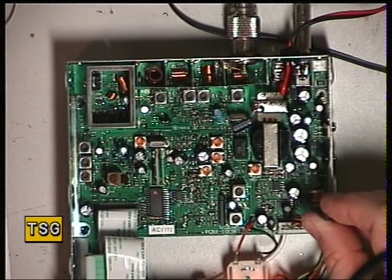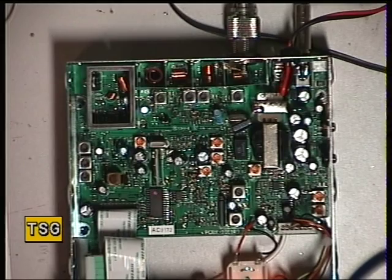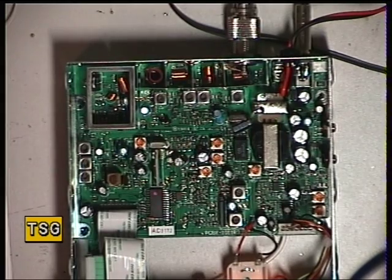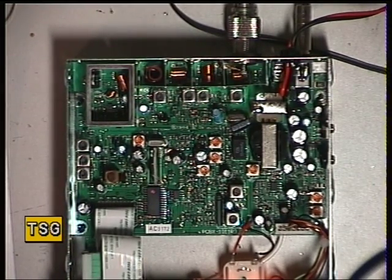I'll try to turn the power back up to four — we're getting three and a half. I don't think there are any further transmitter adjustments so that's what we're going to get. The thing about this test set — it's a commercial test set — when it says three watts and four watts, these are real watts. These aren't 'good buddy' watts. You can go and buy relatively cheap power meters and I'm sure this radio would probably read seven good buddy watts, but these are real watts. So it's doing three and a half, and that's about what you'd expect. Now we'll go through the deviation in just one moment.